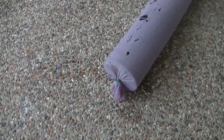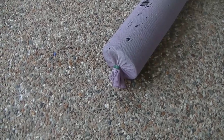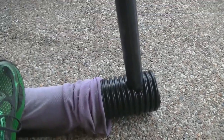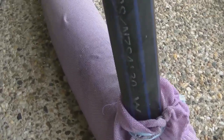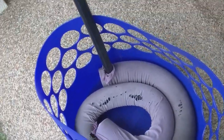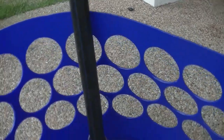This black PVC pipe is the fill pipe that allows us to fill water directly into the slotted ag line. The other end — which doesn't have the slot — I've tied off and sealed with a bit of gardening baling twine. On the fill pipe end I just put the pipe in with a wiggle, nice and straight down. On the other end I've pulled the geotextile sock over and wrapped it, securing it with baling twine. It sits curled around on the bottom, and this comes up a bit high so we may trim it later, but it'll stay for now to make filling easier.